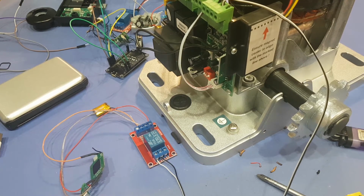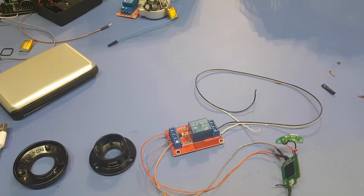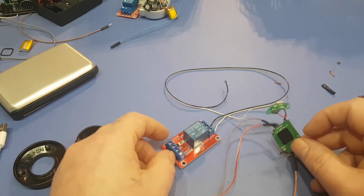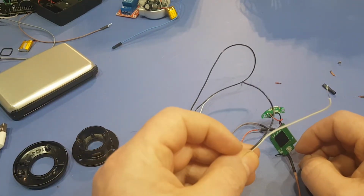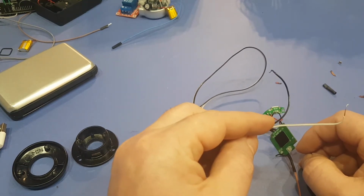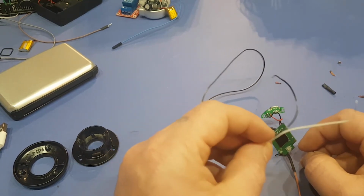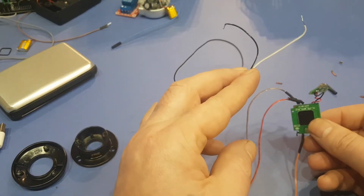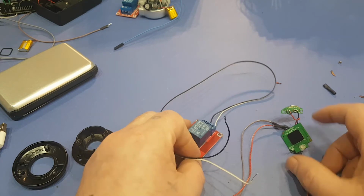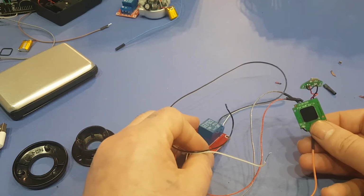All right, I'm just going to unplug this AC here so I don't die. All right, guys, that's it for this video on this module here. As is, you can hook this up right up to a computer if you wanted to, and just splice into the 2 power wires that go to the motherboard and to the switch, and you can switch on and off your computer by fingerprint. Again, the bonus of this one here is there's no buttons, there's nothing on it.